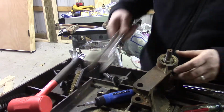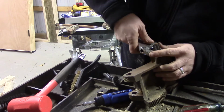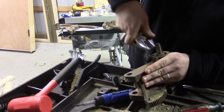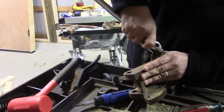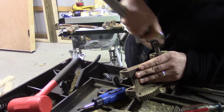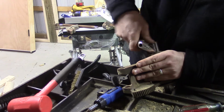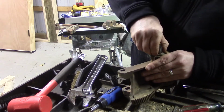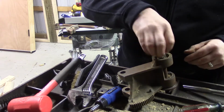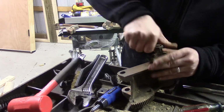This is a couple days later, after I did some more shopping, because I still had electrical to do out in the shop. This retaining nut was barely finger tight, which might explain why there's some slop in the arbor. I didn't have a ratchet big enough to remove it, but a monkey wrench turned on its end works just like a screwdriver. And here it was just held up by that little burr that I threw up when I was removing it with a screwdriver and dead blow.